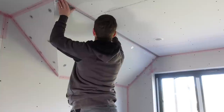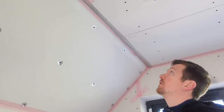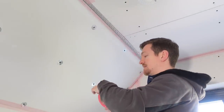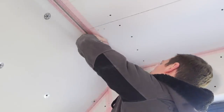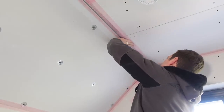Just cut it where you need. I'm also going to scrim tape the bead because, to be honest, the staples don't do a great job of holding these up. We've got them up initially, but the scrim tape will not only help stop it from cracking — it's just a great way to fix them up.